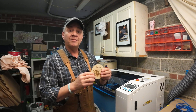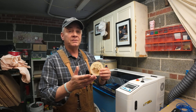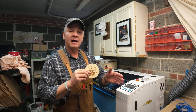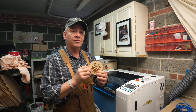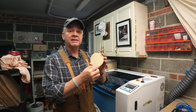These results came out of a number of different combinations. I could actually cut successfully at 20mm per second and about 53% power, but only once. As I kept repeating it through different designs or different cuts, I found that depending on where I was on the board, it either wouldn't go all the way through or it went most of the way through and I had to snap the piece out, which left splits at the back. So that's where I got the cut layer settings from.